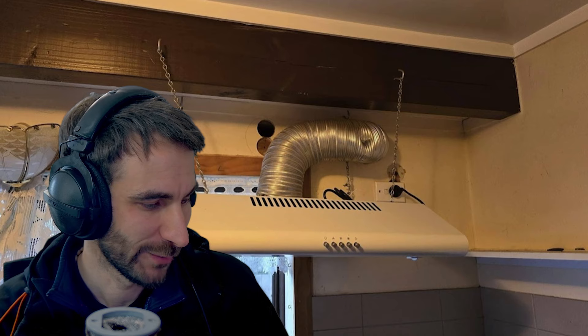I got asked to go and duct that range hood externally. I posted in an electrician's group with a troll post saying, what are the rules about running ducting past the switchboard? You've got to be careful posting in a group like that because somebody might think it's a serious question and you could get roasted. You're not allowed to have a switchboard above a stove like that because it needs to be accessible. Above a cooking surface is not considered accessible because when there's an electrical emergency — it could be a fire on the stove — the last place you want to be needing to go to turn the power off is right above that fire. What we ended up doing was moving the switchboard, which was the more expensive option. My suggestion was to move the oven — I found a spot where we could put the oven with external ducting and get the power there. But they opted for moving the switchboard, which cost a couple of grand.